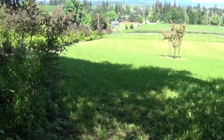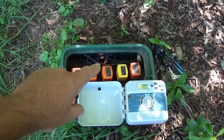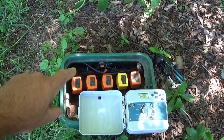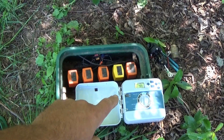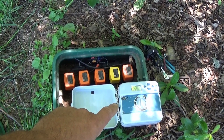In this case it's working just right. It'll run the little micro spinners just fine. This series of valves is a 24 volt valve. It operates on a 24 volt system, just like a solenoid valve does. We can run it off the transformer off your regular sprinkler controller, as long as it's running 24 volt also.